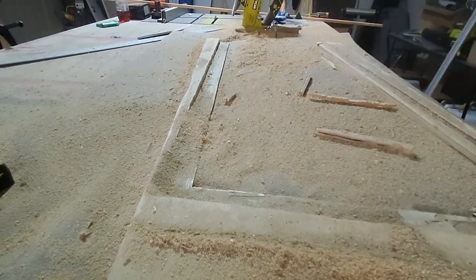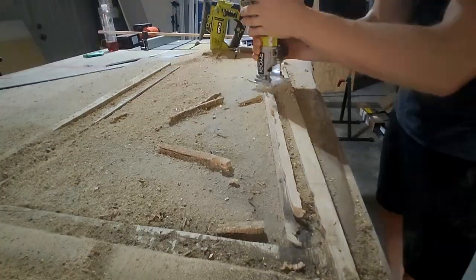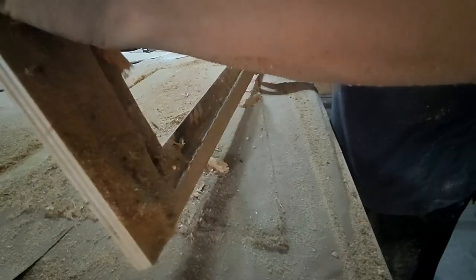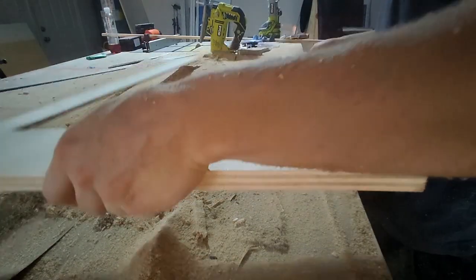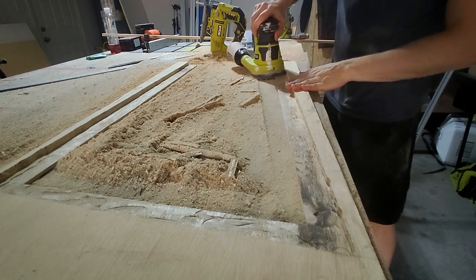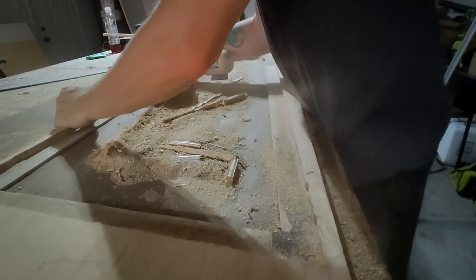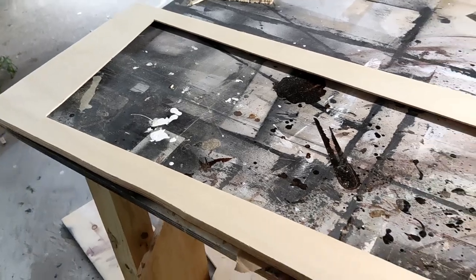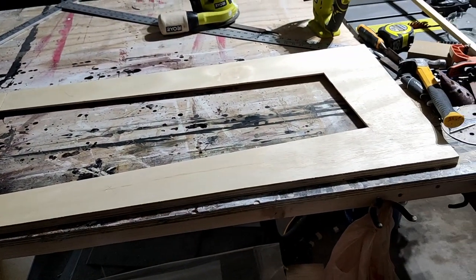So I decided to make an asymmetric geometric pattern on the entire back wall with inlaid lighting, and the backlit part would actually shine up on a textured wallpaper. Now, the objective of the backlighting is to create an illusion of depth, and to achieve that, I'm routing out a good portion of the geometric frame to inlay the lighting deeper in the frame itself. Not the easiest job to do with a little tiny router that I have. Definitely more of a job for a real man's router, the one that plugs into a wall and maybe has like a 1.5-inch wide bit and not a 3/4-inch wide bit.